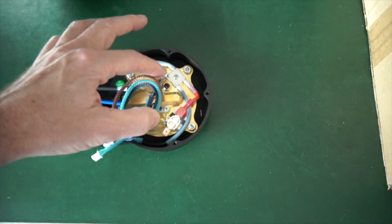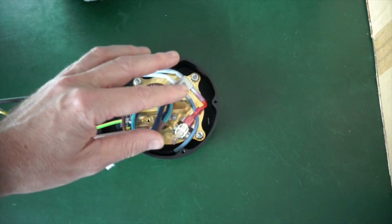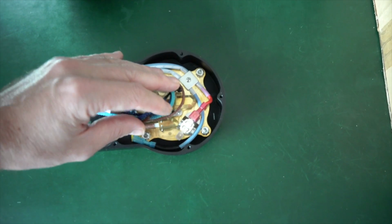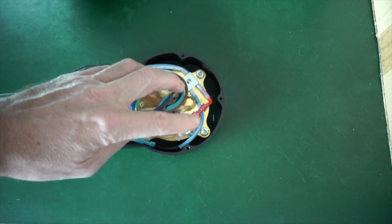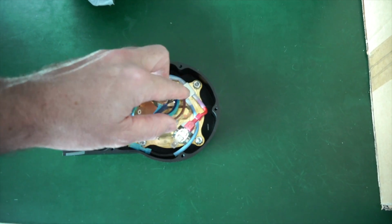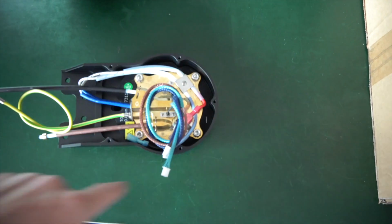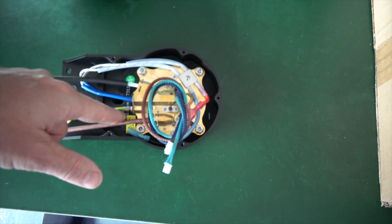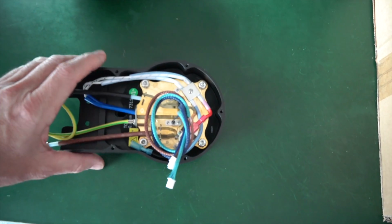In the EU, you have to have a double safety, and it has to blow permanently, which is what we've done here. Under US rules, you're allowed to recover, which is why we have a thermostat here. And this German-made thermostat is supposed to always interrupt the power before these thermal fuses would ever blow. New to this version, we're now coating this in black. And also you can see here's that group head separator that I showed you earlier, which defines the spacing.